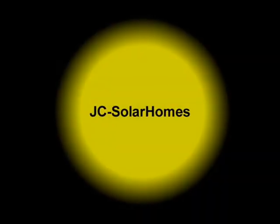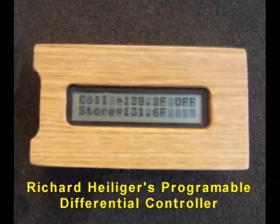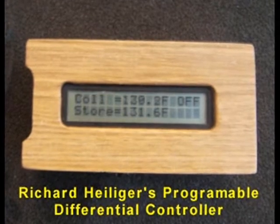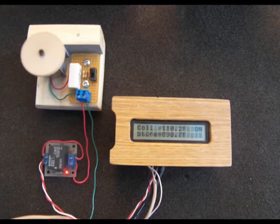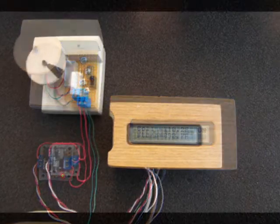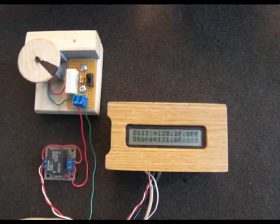Today we're going to bench test Richard Helliger's programmable differential controller with a remote relay wired to a DC motor. The relay is used to transfer either AC or DC power to a pump. The controller should never be connected directly to the pump, but this relay can handle over 200 watts of power, and larger relays are available.